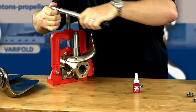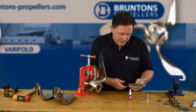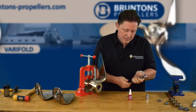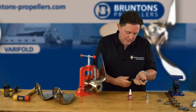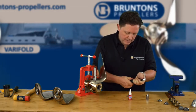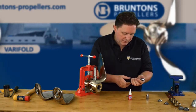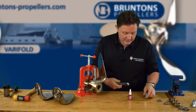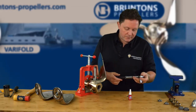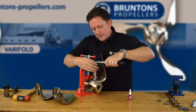So that one just sits in like that. It's getting a little bit tight there. So what I'm going to do now is set my torque wrench. This one we're going to set it for 15 Newton meters. Now in the instructions it says 20. I like to do it just a little bit below so we can feel how the blade is, and then beef it up. So 15 — that is around about 140 inch pounds for the Imperial SAE guys. So this is just a little 20 to 200 inch-pound torque wrench, just off Amazon — very inexpensive — and it's going to do the job. Let's see if we can get it to click on camera as we tighten up.